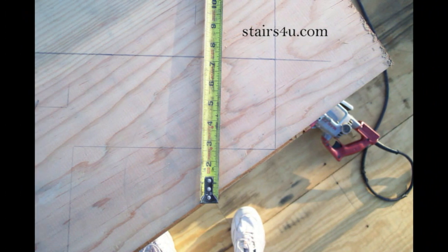I will actually take the tape measure and use the riser measurement — this would be the overall riser measurement. In this case it's about 7 3/8ths of an inch, and I'm just estimating where the bottom of the tape measure is located. I place it at the bottom of the stringer — the very bottom of the stairway — and line up the riser measurement just as you see in the picture here.